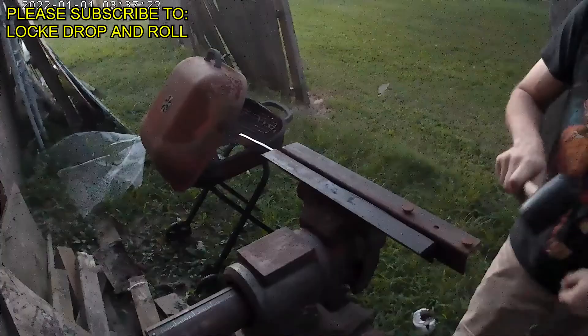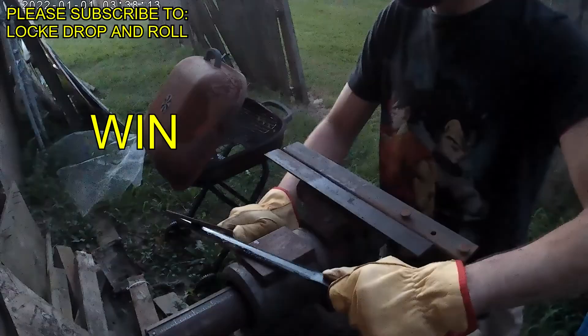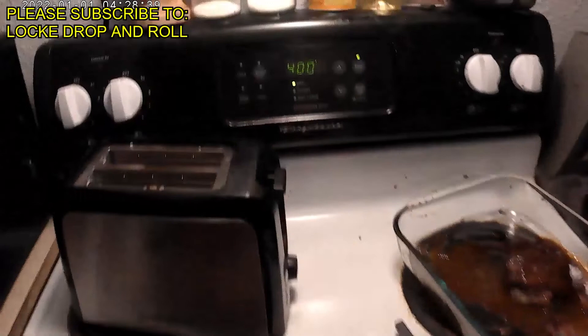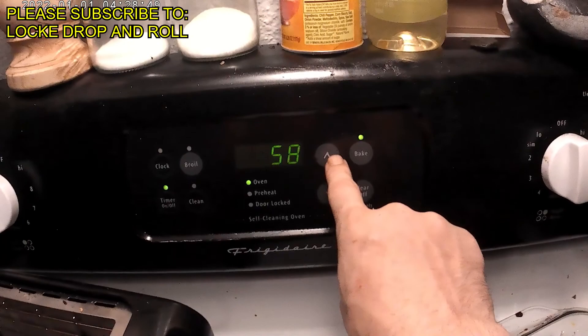Looks like it was a nice temperature. After it cooled down in the straightening jig, just to make sure it's straight, we're going to go ahead and file test it — the file should feel like it's skating across ice if your blade was quenched correctly. That's a nice look at the blade after it has been quenched. Now we're going to want to temper. Your tempering cycle can be in the oven depending on the steel, but this is spring steel so we're going to do two cycles of one hour at 400 degrees. That should make the metal not brittle and a little bit more malleable.